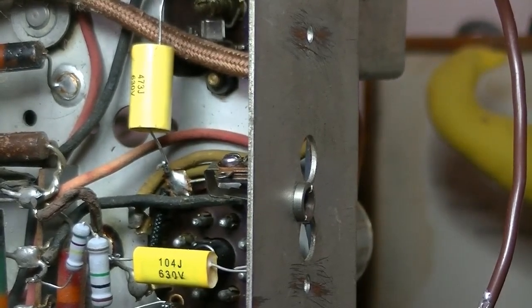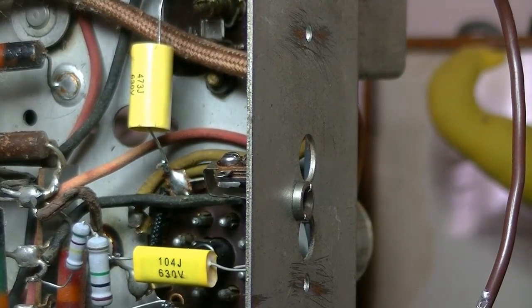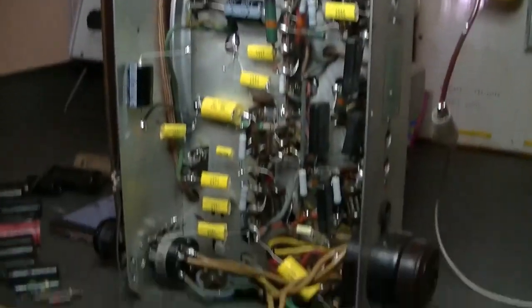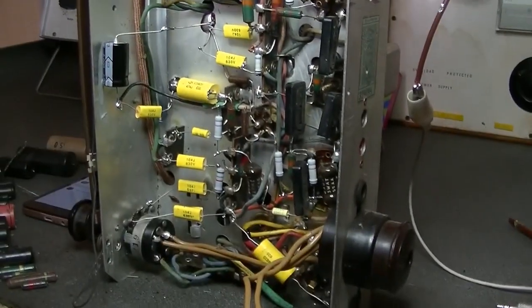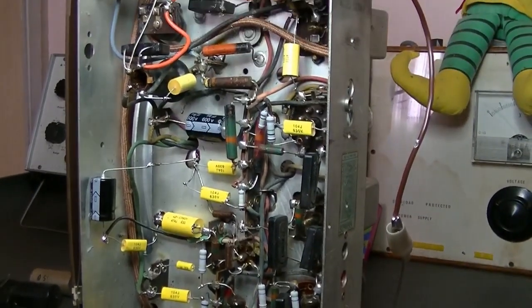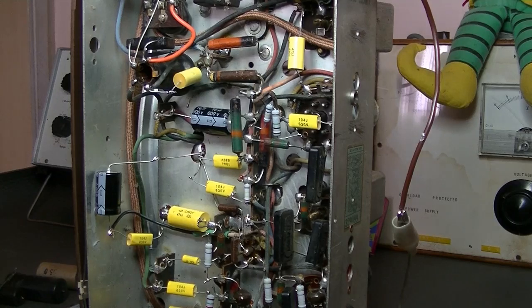Let me switch back to the radio. I think I did a pretty neat job, actually. It's quite easy when the original build is done in a very neat way — easy to follow. Anyway, that was fun. Not much to show in this video except, like I said, a bit of smoke and some sparks at the beginning. Simply deteriorated insulation that was jumping across and arcing. Problem solved. Thanks guys, thank you for watching, and I'll catch you all again very soon.